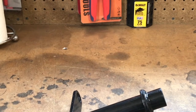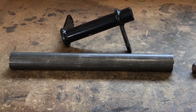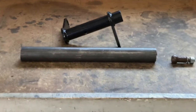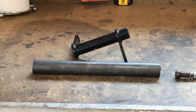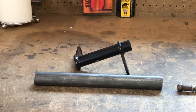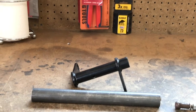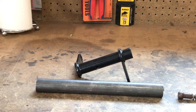So the first thing we need to do when we get the motor out is cut that casting. This is a mock-up block, so we can do that without worrying about ruining something — this block is mostly for positioning, he doesn't think he's going to use it for a permanent motor. We're going to try and cut that casting, thinking that the bump-out is solid. It looks like some kind of support feature, maybe for stacking the motors. But at any rate, we're going to try and create some clearance.